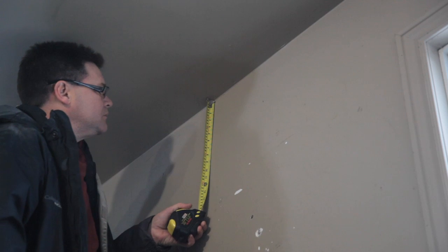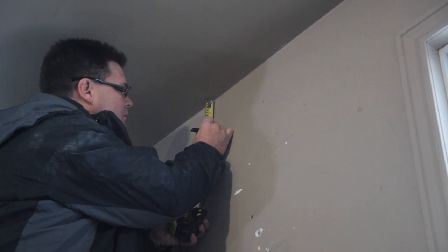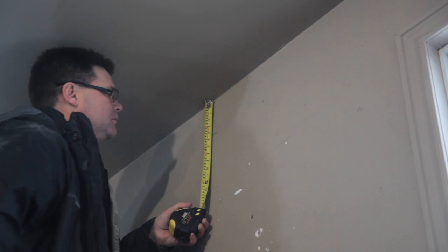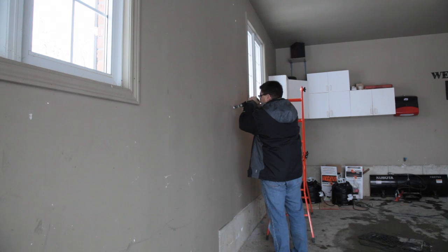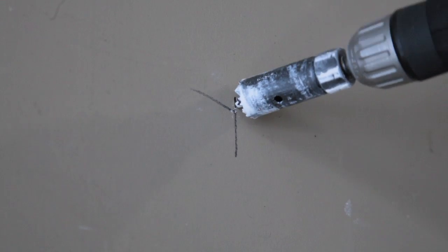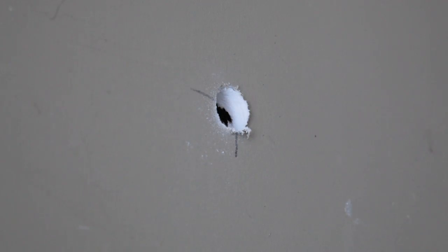In this garage, there's solid wood above the windows, so no injection is possible there. Drilling through drywall is fast and simple because this material is so soft. To make the injection process easier, slope the holes downwards from horizontal by 20 or 30 degrees as they're drilled.